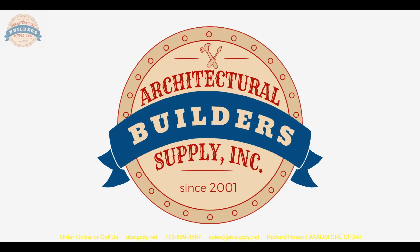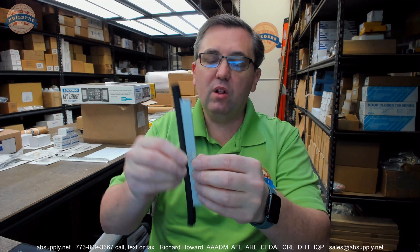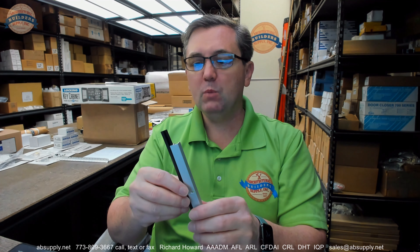In conclusion, this is a very nice quality material with a clear anodized finish — we'd call that 485AA. I would recommend ordering the material a little bit long and then putting a miter at the header and jambs to make a really slick, clean installation. You wouldn't need it much longer, maybe a couple of inches, just to give yourself a little room at the end to cut off. You want a longer length that you can actually clamp down to keep the piece in position, as aluminum is a bit tough to file when you want a nice clean miter.